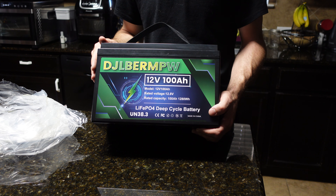Now we're going to charge it and get ready for the capacity test. The charger we're using is a 6 amp charger that charges to 14.6 volts, which is perfect for lithium iron phosphate. The battery shipped at 13.19 volts. I'm going to hook it up and let it fully charge. When the charger hits 14.6 volts the light will turn green, and then we'll do the capacity test at approximately a 0.2C rate.